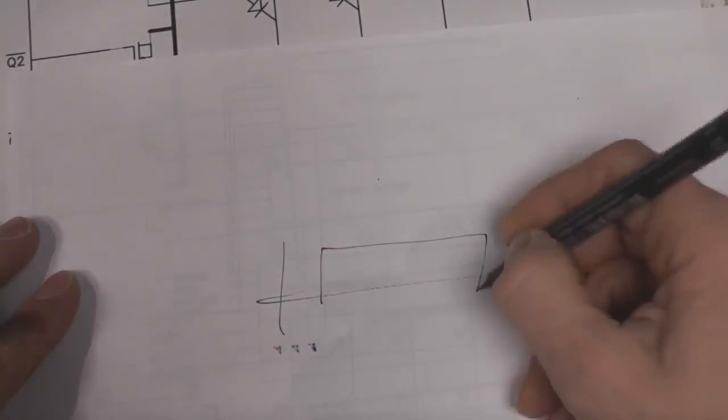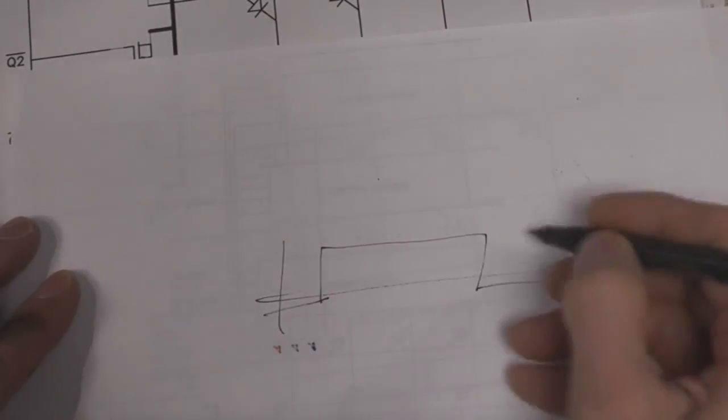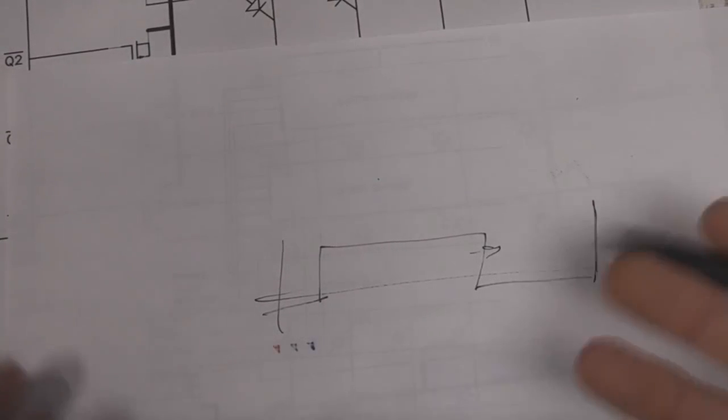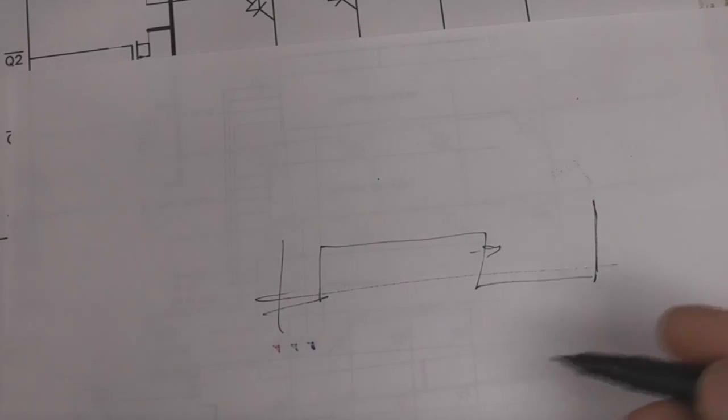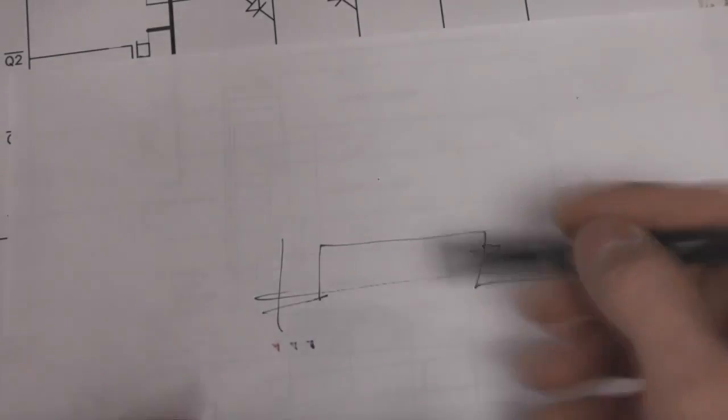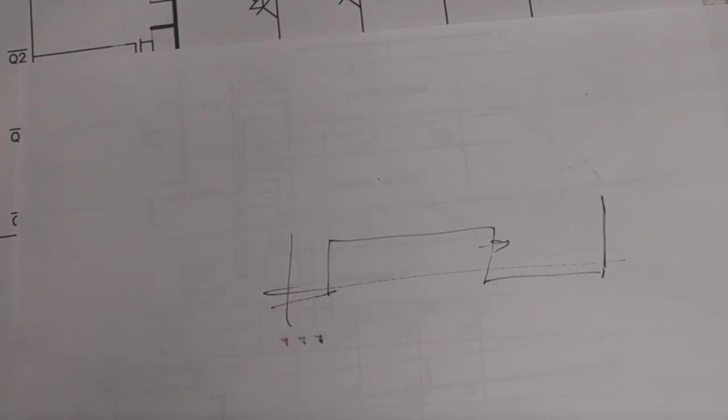Difference between these drivers and the ones I tend to use in the past is there's no built-in modulation. So how do you do the grayscaling? Now, obviously, the conventional way of modulating a LED is you give it a variable length pulse. The longer the pulse, the brighter the LED goes. Now, this is fine if you're driving small numbers of LEDs, but it doesn't really scale very well to larger arrays for a number of reasons, because effectively in each column you actually have to have your separate PWM register and a counter, which ends up using quite a lot of logic.